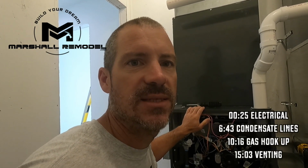This is a pretty easy installation. You just put the 3/4 inch fitting in there, glue your 90 on, and then set your float switch in there. There's 2 wires that come off, and you can either break your red or yellow wire coming from your thermostat to your furnace. And if you are putting this in conjunction with any other switches, you want to wire them in series.